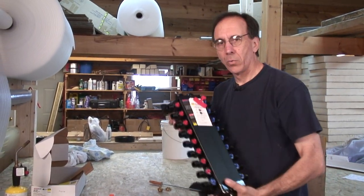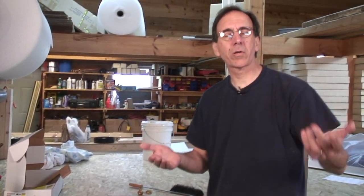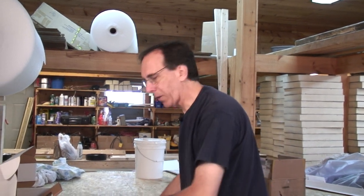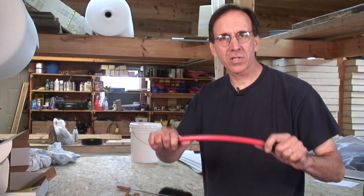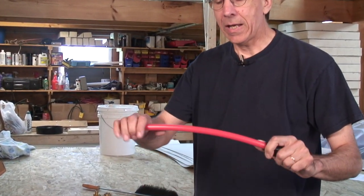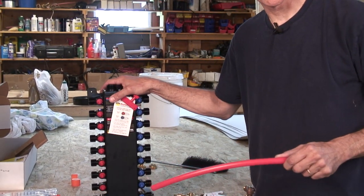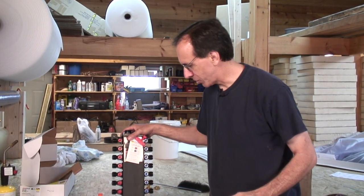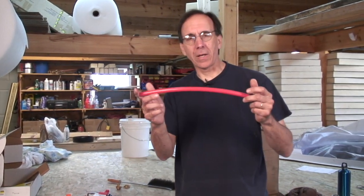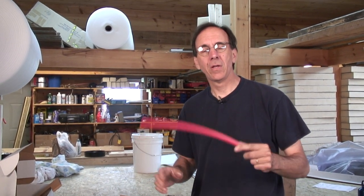But we're gonna do some plumbing here at my shop today. We're gonna replace the old copper plumbing system with this, and we're slowly gonna transition things over. This is made for use with PEX tubing. This is cross-linked polyethylene tubing. And what's beautiful about this system is the manifold plumbing system lets you do what they call a home run plumbing operation. And what we do is we run tubing, working with flexible plastic tubing, which is relatively inexpensive.